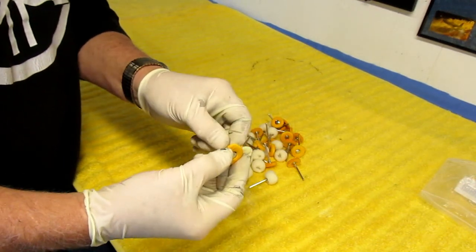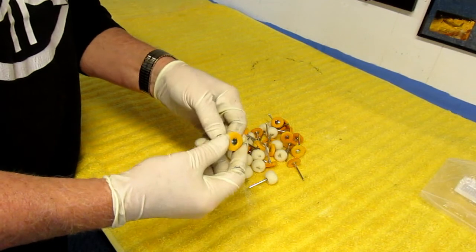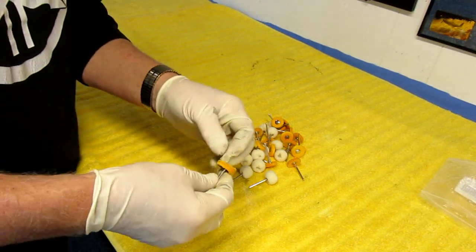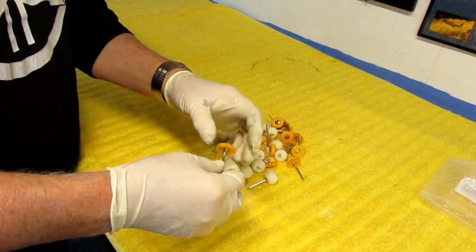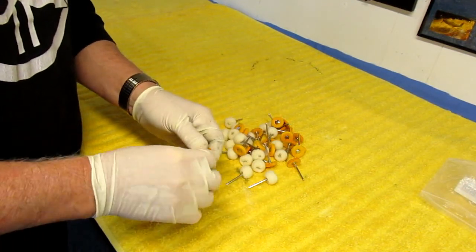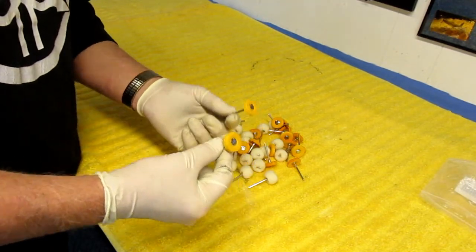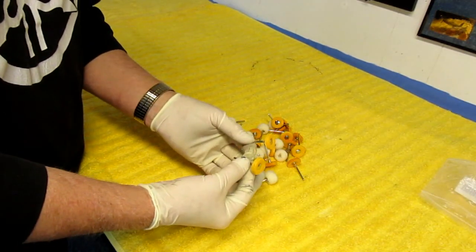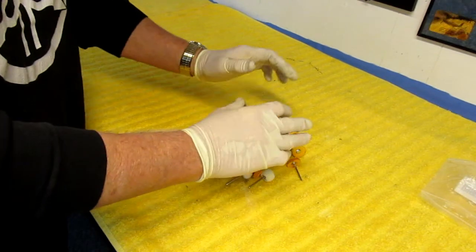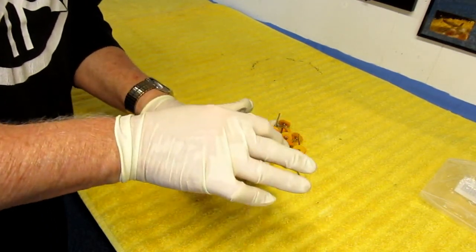Same thing with these. These are usually made, you put wax on it from a candle, ordinary candle wax, and then some rouge, of which there is black, red, green, and you can buy that rouge in Harbor Freight, about $6 for a stick. So again, all inexpensive stuff, all basic stuff, but I think, like everything I try to do, is use basic tools, inexpensive tools, and basic knowledge to come up with a really good result.